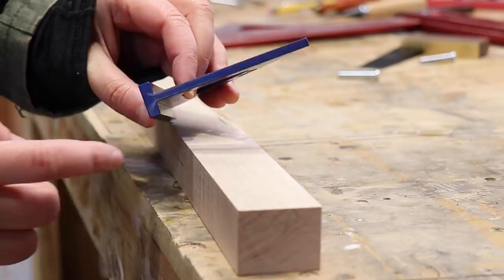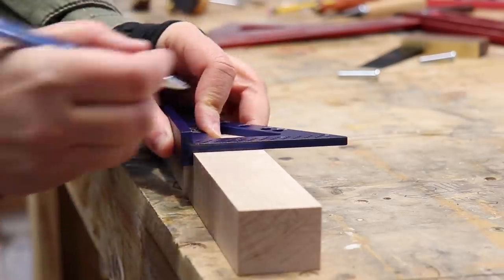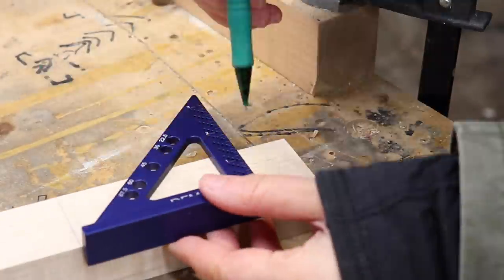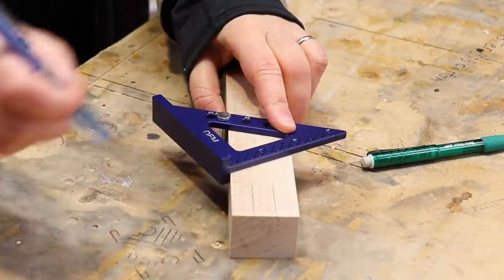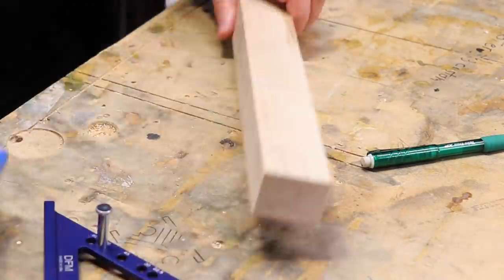Another great square from DFM is their small carpenter square. I'm not sponsored by DFM at all, but I have met the owner of the company — he's a cool guy and they're made in the US, which I think is pretty cool, and they're really high quality. Besides using it to set up tools or mark for cross cuts using the lip on the bottom, it also has small holes every sixteenth of an inch so you can scribe accurate lines with a pencil. And these larger holes you can place a pin in to accurately mark out key angles.